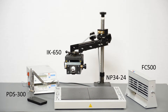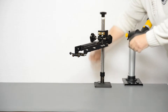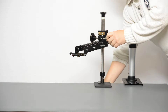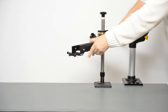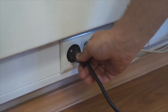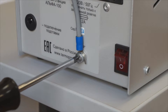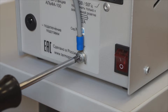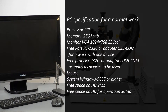When choosing a working place for the complex, please keep in mind the following criteria: the working place should have enough space with no obstacles for top heater holder arm rotation; soldering fume extraction should be available; a 10A power supply line is available; all sockets have earthing and the air cooler case is connected to the central earthing line; a computer meeting the specification presented in the software manual or higher is also available.